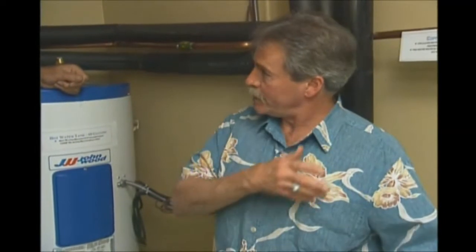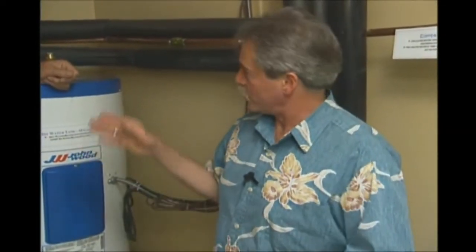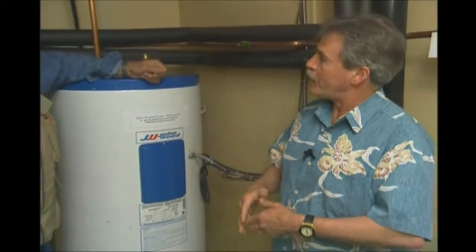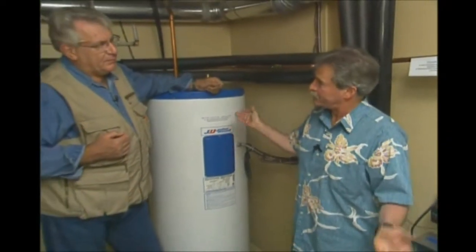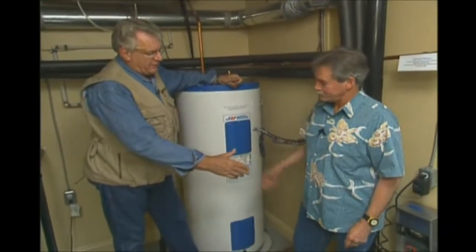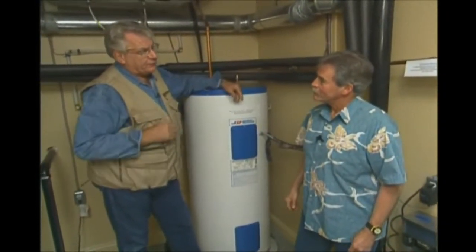What the industry has done now is extend the range of residential equipment and make it possible to use earth-coupled loops, using the mean soil temperature of the earth. This gives greater efficiency — it's a much steadier curve — and you don't need the additional commercial equipment on site. It really is the system of the future.